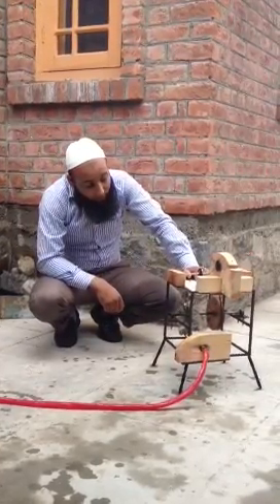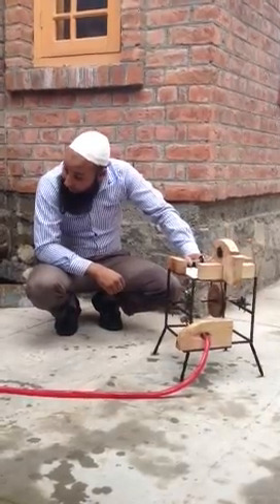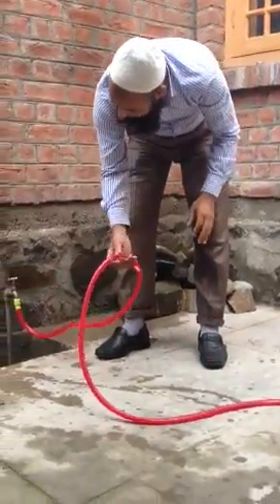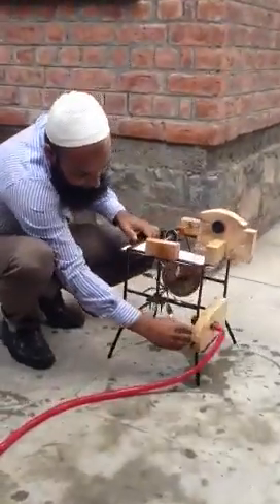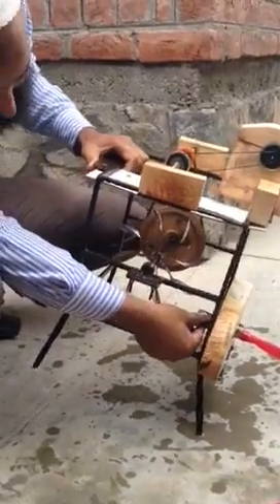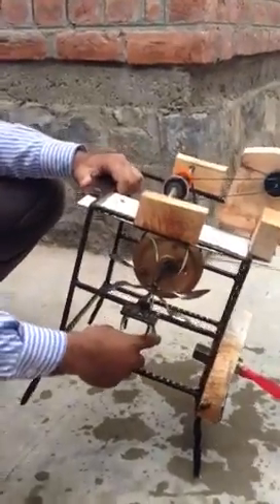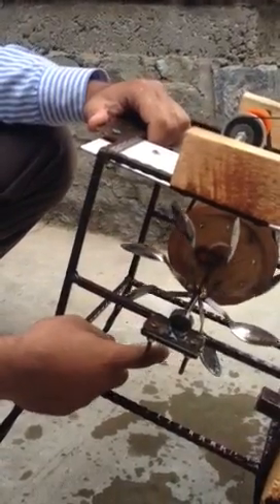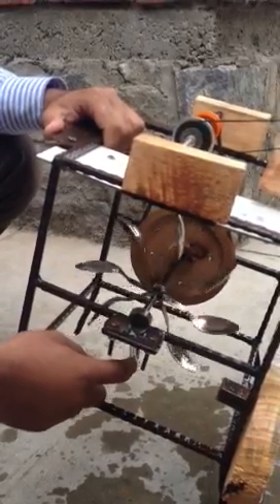This is a hydro pico hydro, or generally units which will work on tap water. This is a penstock through which the water comes from this tap, and then it comes here — there's a water jet which works at a zero degree angle of attack. It is normally 2.5 mm, and once the water comes with pressure, it gets pinged on this turbine blades. There are eight blades, and these blades are getting impulse with respect to this water pressure.